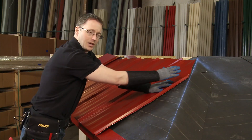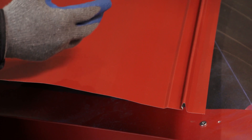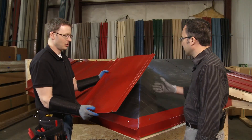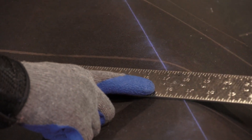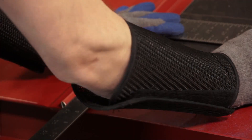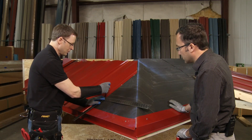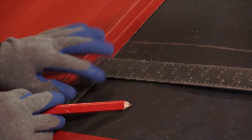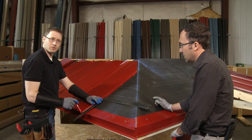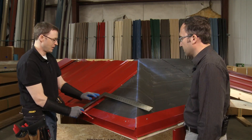The last panel we installed already had the bottom prepared for clipping over the drip edge. With this panel, we're going to leave the end unfinished to show how to take measurements and account for the one-inch clip. We have the 17 and a half inch mark on the square and we'll calculate for the short. We put it on the inside of the last panel, butt it up against the rib, move up until we hit our line, and transfer this line over to the panel. For the hem, we're going to account for one inch, so we'll add one inch to each of these measurements.